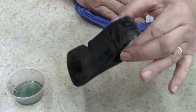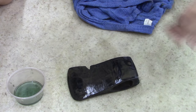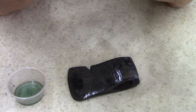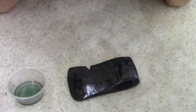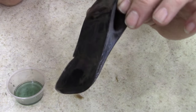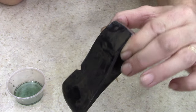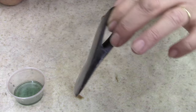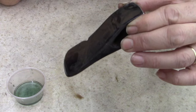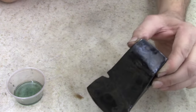And I do like the bluing. And this stuff, it says let it sit for 30 seconds and then wipe dry, and then 4-0 or 1-0 steel wool or something. I use 4-0. I'm letting this sit longer. And this pretty much was a worthless hatchet. Now it's actually going to work. I'll probably wind up giving this away the end of this year for Christmas. Pretty sure that's what I'm going to do.